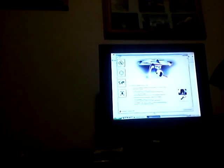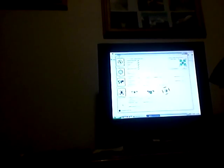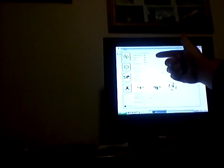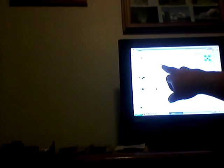So we've got the GUI up. Now we're going to go ahead and power the quad up. And immediately it connects, and it immediately pops up to the sensor information tab. Now it's got the orientation sensor and the IMU, the pressure sensor, which is your barometer, for your altimeter, compass, GPS, and your speed controller. So this goes through and checks all of them real quick. It shows your battery voltage, your accelerometer, your gyroscope, your orientation.